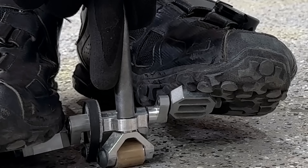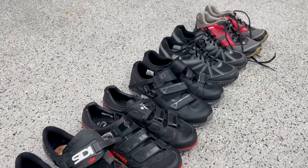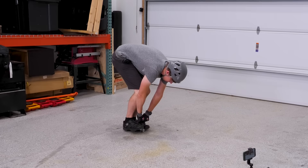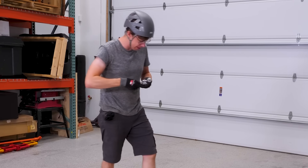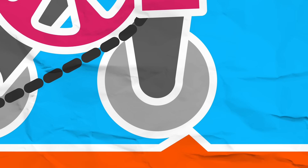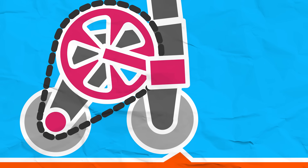You can't use the pedals without your foot hitting the crank and jamming everything up. I tried every shoe and even no shoes, but the pedals are just too small, so I went back and made some human-sized pedals. I was feeling pretty good until my worst fear happened — the belt is skipping. If you put too much force through these belts, the teeth can skip. What's happening is I'm hitting a little bump and the bike has to lift my whole body weight, which makes way higher force and it skips.